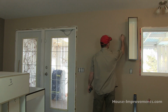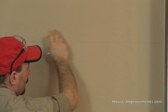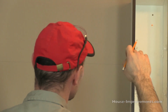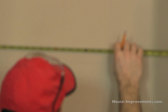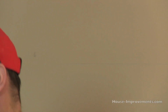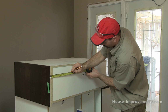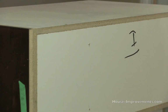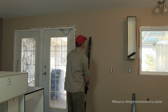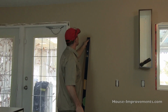Now I'm going to mark out. You can see I've got a fair bit of framing here to choose from. I'm definitely going to use this set down here, and I'm going to use, where was that opening, so I don't have that same problem. I should be able to use this one. So those are the 4 positions I'm going to use, so 10.5 and 35 and 3/8. So I've got my cabinet sitting. I'm just thinking so I don't make a mistake. I can measure from this end, 10.5. Use this level as a bit of a brace there, so when I get the cabinet sitting up close, that level will take some of that weight and I won't have to struggle myself quite so much.